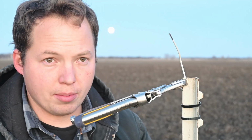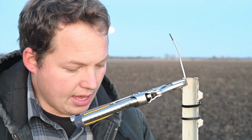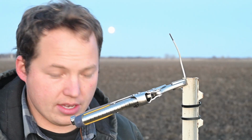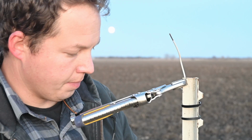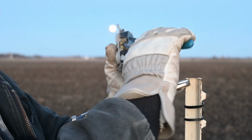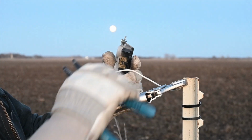This is just for demonstration purposes, but it's always going to be in a more intermediate voltage like 7200 or 10,000 volts, where you would actually be using that for a single wire earth return. I'll make sure I put some links in the description if you guys want to read more about it. So we'll start by hooking the return path, which is white, which is what it's supposed to be. This is our neutral, going back to the center tap of our transformer.